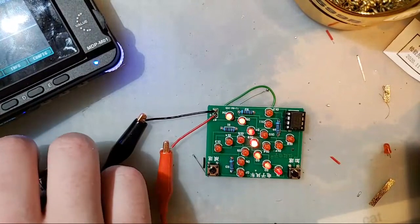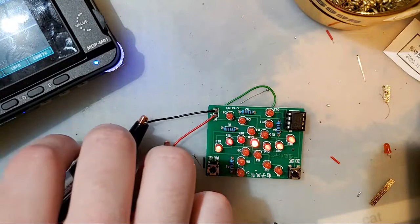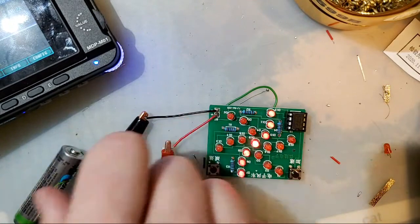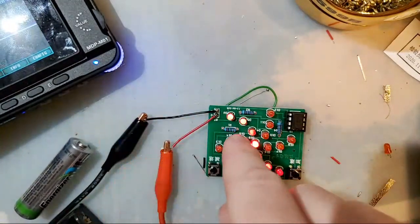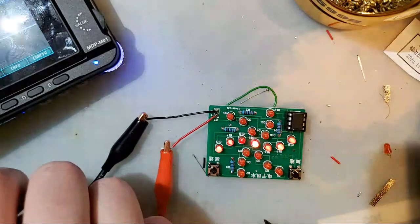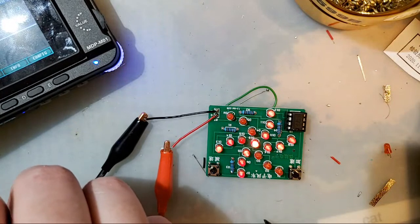What is the best temperature? I use 300 degrees Celsius. That's the temperature I'm comfortable with. You can use a hotter temperature if you're soldering bigger things or if you're moving really quickly, or you can use a lower temperature if you're moving really slowly and working with smaller things. But I find 300 is the best bang for buck, the best all-around value. I'll adjust it depending on what I'm doing, though. That's just what I start at.